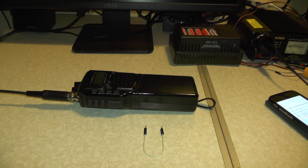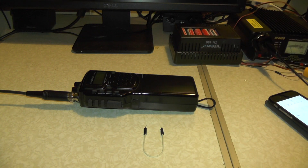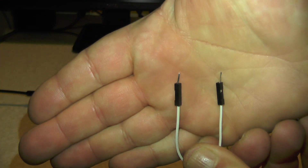So how do we go about modifying this radio? Well it's nice and simple. Underneath the PTT switch, under the rubber cover, there are five solder points and we need to bridge out pins 1 and 2. If you've got something between pins 2 and 3, remove it and you can do this mod. You can use a pair of tweezers or you can use a piece of wire like I'm doing there. I'm using this breadboard wire.